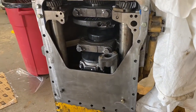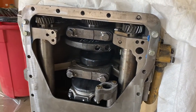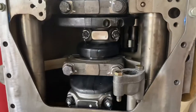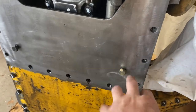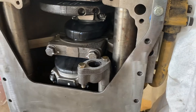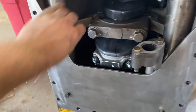This is how to time your 3304 — it has got balance shafts, one on each side. Top dead center number one: I know this because I just put the cam in before I set the front cover on, and I left it alone — number one piston is all the way up. The block is threaded and your adapter plate here just has a hole, no threads. There's a little cutout inside the balance shafts on each side, and what you do is thread this in all the way into the balance shaft and lock them in place — you can't rotate them once they're locked.